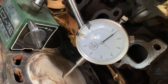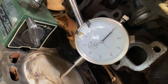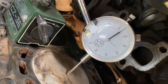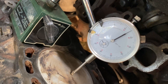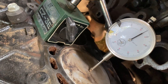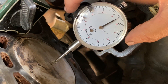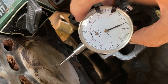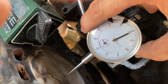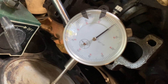What I'm going to do is go back, then go forward again until it gets to 14.5. Now I'm going to zero the indicator here. Keep in mind any pressure on this stand is going to skew the measurement. Alright, so now it's at zero.